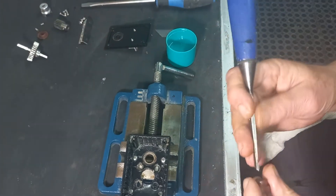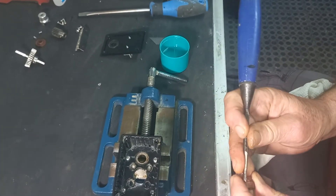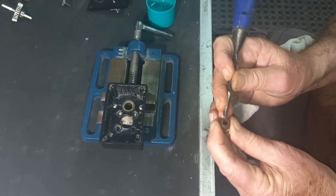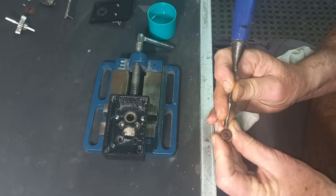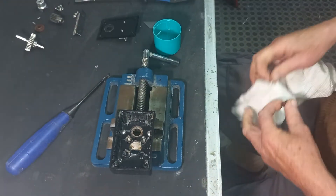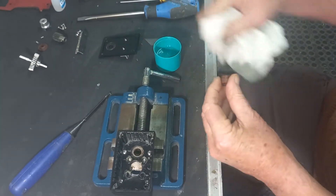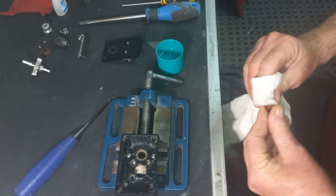Give the bush a clean — just make sure that there's no glue on there. If it's got lumps and bumps just scrape it off, same way, all around the edge this way as well. And using acetone or lacquer thinners — I've got acetone — you're going to clean this up to remove any grease.